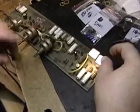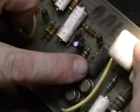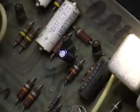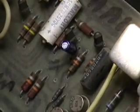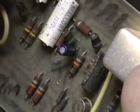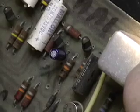One more thing. When you get the kit of parts from us, you're going to make a notation. The capacitors that are bipolar in the vibrato were 5 microfarads, and the ones we sent you for the vibrato were 10 microfarads. There's a reason. We have found that over the years, the capacitors tend to change value, and not in the direction where they increase but decrease. Second of all, we've had a number of complaints from people who say that the vibrato does not switch back and forth slow enough. In order to address both of these issues, we increased the value to 10 microfarads from 5 microfarads. There is no harm to the circuit. It will still operate, but the vibrato will go slower.